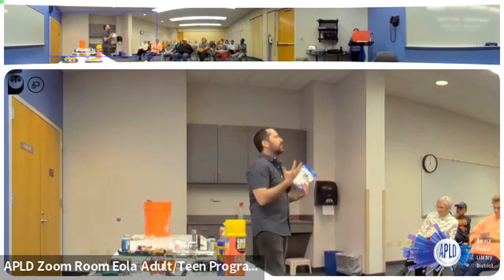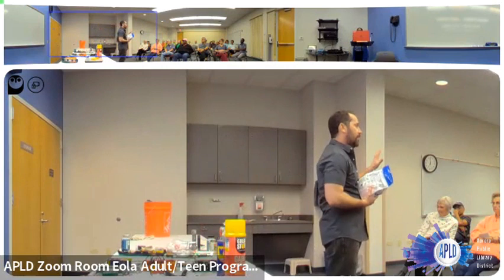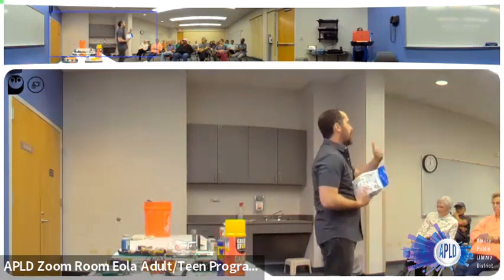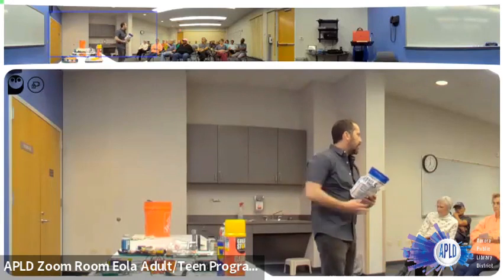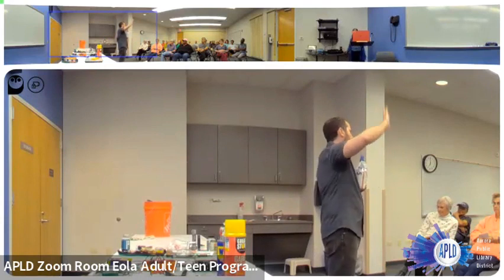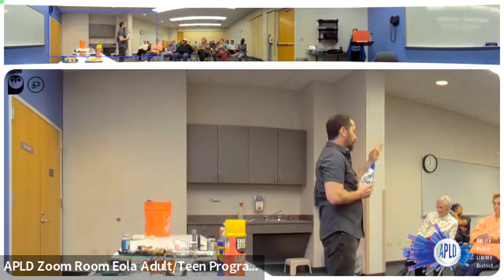So all you do, the paper tape or the fiber tape, the stuff that looks like mesh, it's really up to you. It's preference. The mesh stuff is a little harder to cover. Okay. A little easier to apply. The paper stuff has a tendency to fall off sometimes. The key is you actually have to get that covered with joint compound before you try and stick it to the wall.